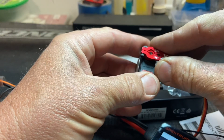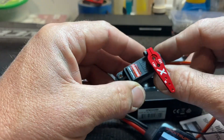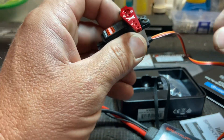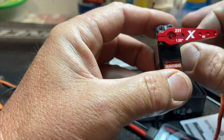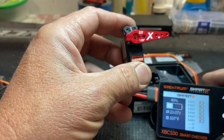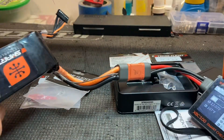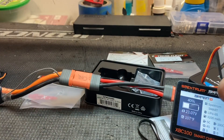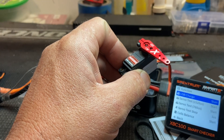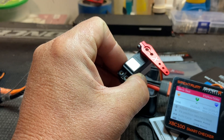I'm going to go ahead and center these servos. They probably come centered, but this is a good thing to do to test servos that may have been laying around or are brand new — to verify they're centered and check how silent they are. I have my Spektrum checker plugged into a nearly dead 6S 3200 battery. I'll push this button here and go down to servo test, and if I double-tap this, you'll see the servo moves.